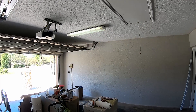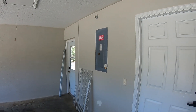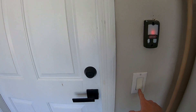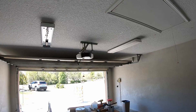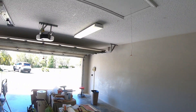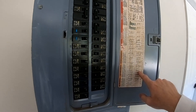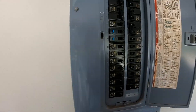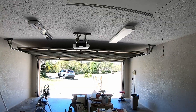Right now the light has power, but before we do any type of electrical work, we obviously want to cut the power off. In my case, I have the panel over here and the light switches right here. That's the first step — turn the lights off at the switch. But I'm also going to come over to the panel. Coming over to my panel, we have the garage lights listed on number 24. Shut that off, and then the power is off to the garage light.